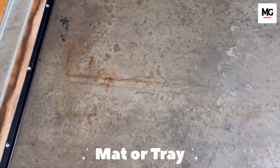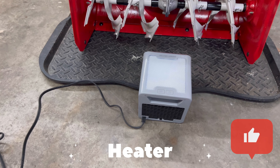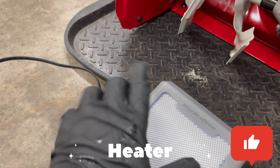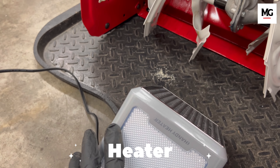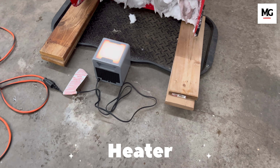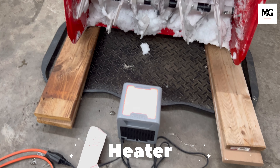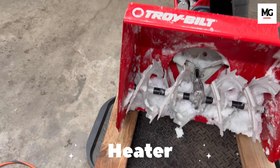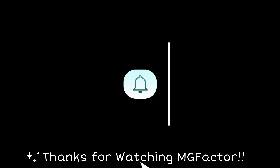Most snowblowers are made of metal, and if it's metal, it's getting sprayed with some kind of rust inhibitor — like Liquid Wrench rust inhibitor, Fluid Film, silicone spray, or even WD-40. These all do a great job protecting all metal surfaces on a snowblower. I like to spray everything down and then wipe it all evenly with a rag. Another tip: take your spray can, insert the spray straw, and spray into any creases or bends in the metal. Inside those little slots, moisture gets in and over time it starts to rust. Wipe it down and protect that surface — if you neglect those edges for a season or two, you will start to see rust forming along those areas.